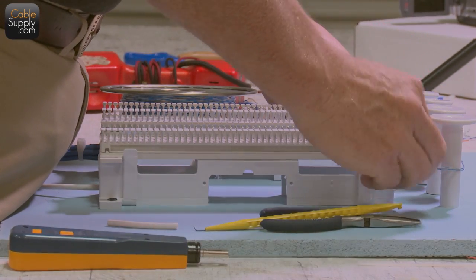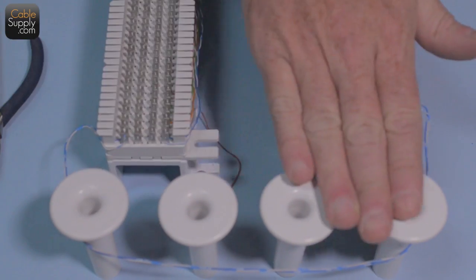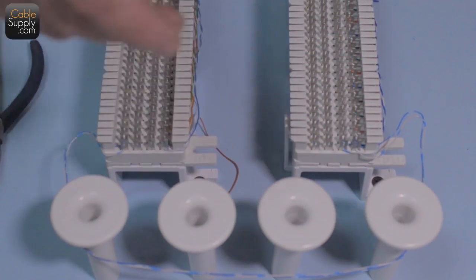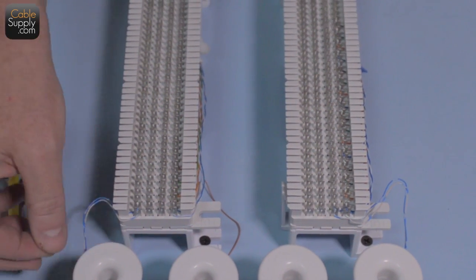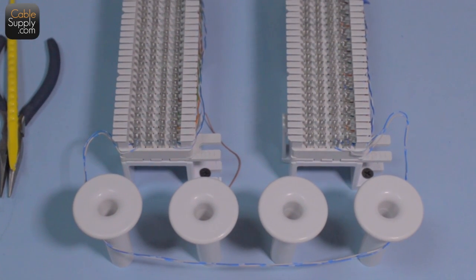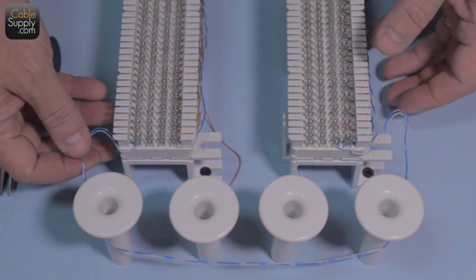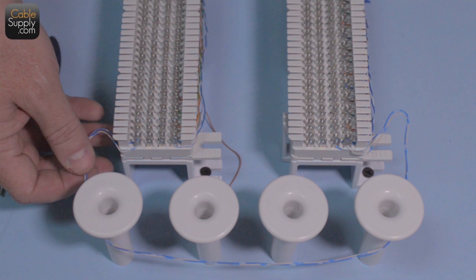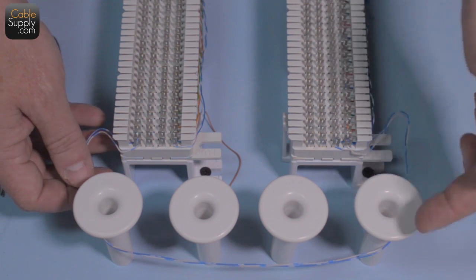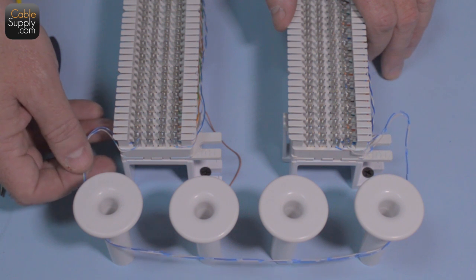Now about mushrooms — they're part of your cable management system. They screw right in, work great, and keep your cables organized. We put two loops in the cross connect so that when there are multiple cables going across and you need to know which is attached where, you just pull on one and see it wiggle on the other side.